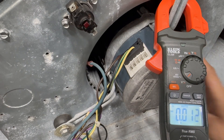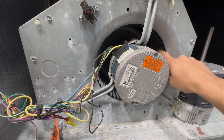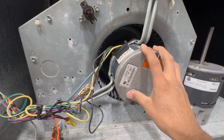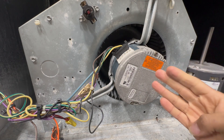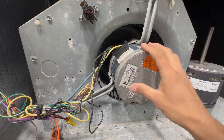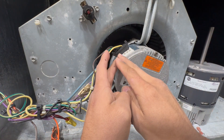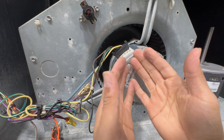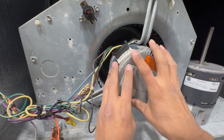A visual test: once the motor is receiving both high and low voltage, if it starts to jitter — kind of dancing up and down with two left feet — that's a good indication the module is failing or already bad. Airflow restrictions like a dirty filter, dirty evaporator coil, closed vents, or a blocked return cause the motor to pull more current. Since current produces heat, the electronics get burned up.